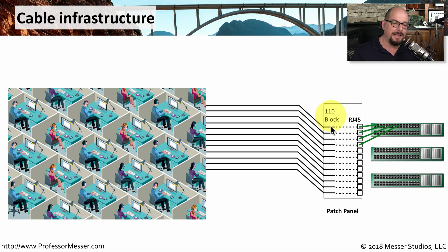This means that we can leave all of these cables in place between the desks and the patch panel. If somebody moves to a different desk, we can simply change the cables in the computer room and plug them into a different switch or a different interface. If somebody new is hired and they sit down at a desk, we only need to add new cables from the patch panel to the networking equipment — making this very easy for moves, adds, and changes.